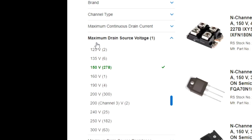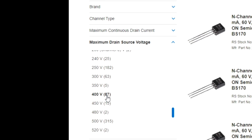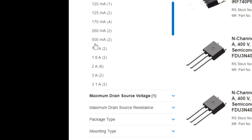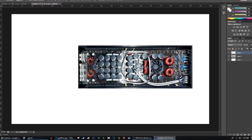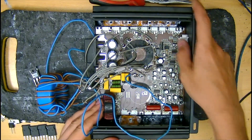from the amplifier. As the voltage limit of electronics components increases, generally you'll find that the current handling of them dramatically decreases. This means that if we start going too high on the rail voltage, it might become hard to find parts that are high enough current rating to survive with the amount of power the amp will be demanding from them. Normally, you would just add bigger numbers of the lower current, high voltage parts in parallel, but in this instance, we have nowhere to put them.